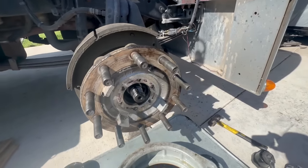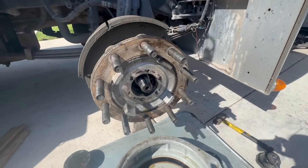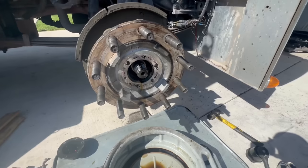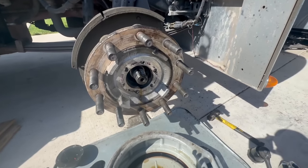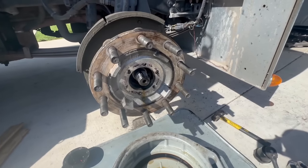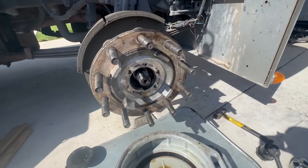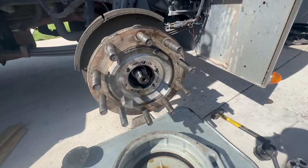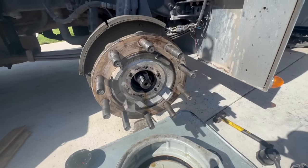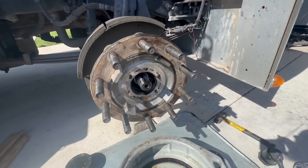So bearings, you know, as long as you maintain and keep your oil level and don't abuse the truck, wheel bearings usually don't fail like that, like in a car, for instance. I mean, they can, but if you run them hot or run them low. Being that these are oil bath, they tend to last longer on a semi-truck versus grease pack. And some trucks will have a grease pack. I've seen them. Freightliner liked to do it back in the day. But most of your bearings ride in oil. Your drive axles ride in oil because the housing shares the differential fluid.